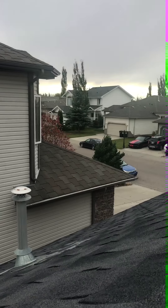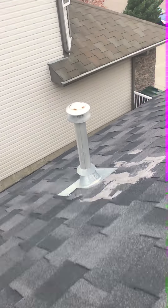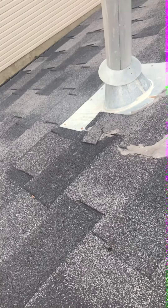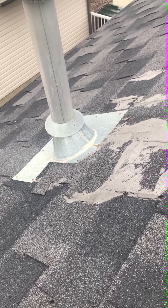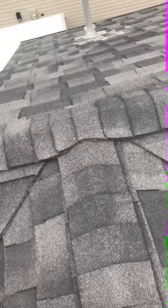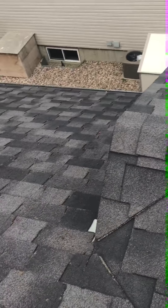It looks like there might have been some problems over here. There are obviously some concerns here, exacerbated by the fact that we have about half coverage there and less than a third coverage there, and we have roofing cement here. Whatever is happening there could also be happening over here — that's the reason for the water staining. You're going to get some exposed nail heads just from age and time. I like that they have a saddle here — that's not a dead valley, but it's going to take an expert to redo.